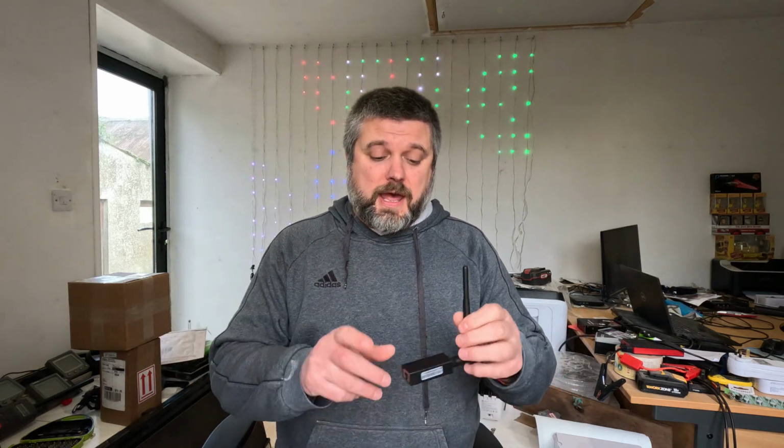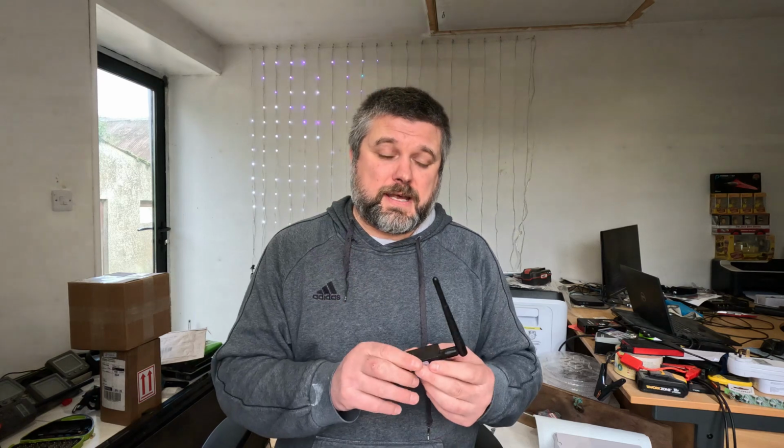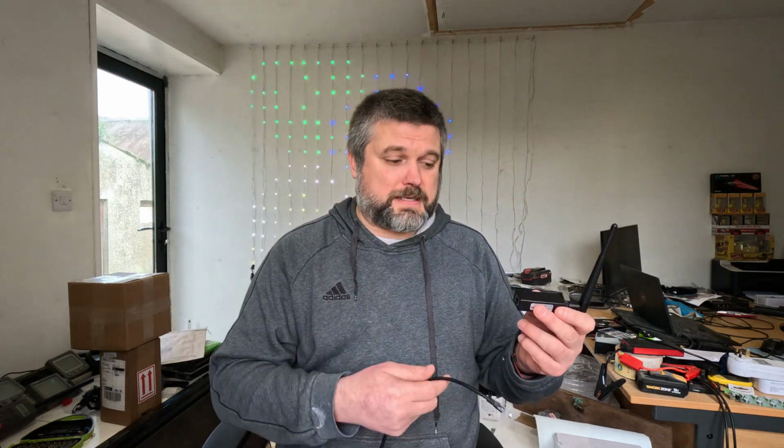Well, let's find out. On my boat I have a wind instrument up at the top which is wireless, so it goes down to a wee receiver, and that receiver spits out RS232. It's actually NMEA 183, but it uses the RS232 protocol. So the plan here is whenever that spins down the wind information, we'll be able to plug this in.